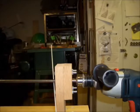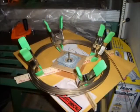The resistance wire used for this project came in a loose coil about a foot in diameter. To make sure that the resistance wire would feed freely to the coiling jig, I built a turntable from a yardstick and a Lazy Susan bearing. I centered the coiled wire on the turntable with clamps. During initial setup, I found that the Lazy Susan bearing allowed the wire to uncoil due to the springiness left in the wire. Therefore, I flipped the turntable over and just let it rotate on the cardboard underneath it. The friction between the turntable and the cardboard was enough to prevent the coiled wire from unraveling itself.